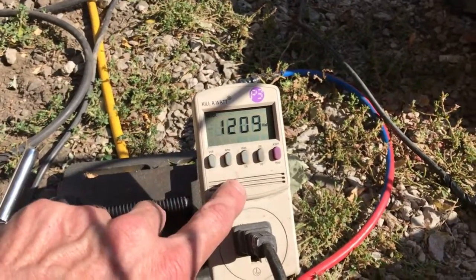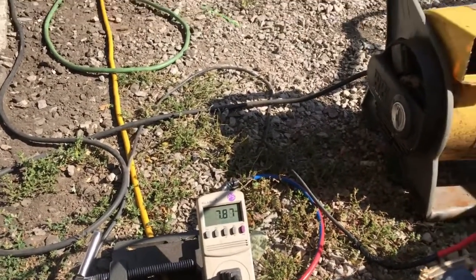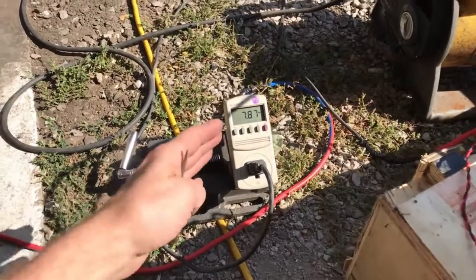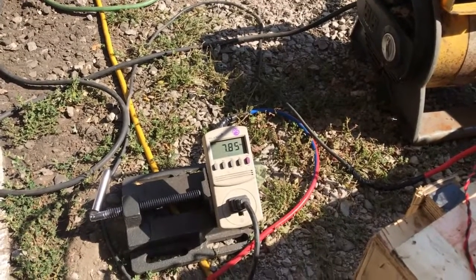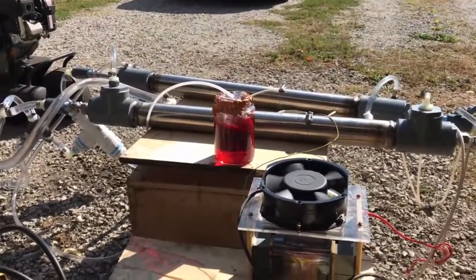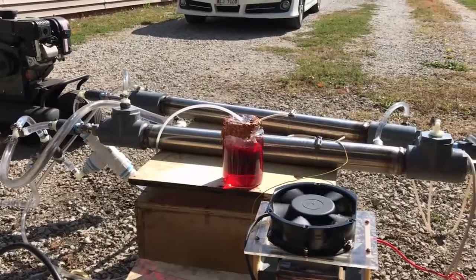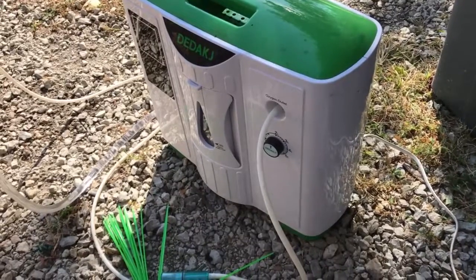This is still a substantial amount of power though - we're running at about four amps per cell almost. The last test I did indicated that four to five amps was the maximum power setting to ozone production ratio, meaning if you go any higher in power, the excess heating in the electrode would decompose any further ozone production gained. Temperature is a huge factor. You could make the most awesome ozone electrode in the world, but if the gap and the spark is so violent that it gets hot - I believe anytime you get over 100 degrees you're really starting to lose half-life. It's within seconds when you're in the 250 degree range.